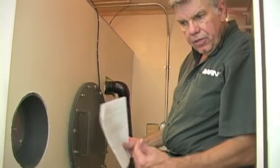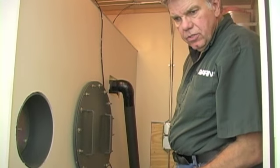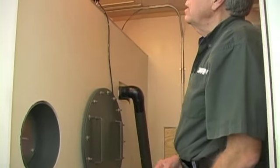Okay, I'm in the back of the unit now where the connections are to hook to the heating system of the building. And the one thing you'll notice is we could not install the flue. Again, for shipping height restrictions, the flue is provided, and the drawings that come with it on how to place the trusses on the roof and stuff like that clearly show where the flue passes through the roof. So you'll have to take the Class A flue that's provided, drop it through the roof, and connect it to the GARN unit, which is a twist lock connection.